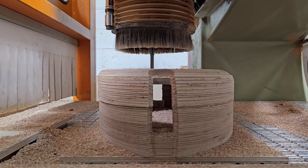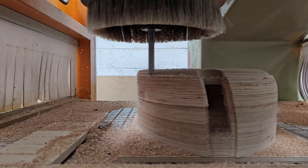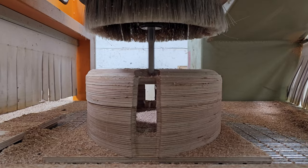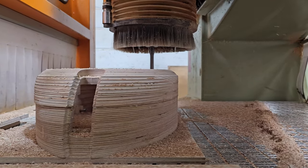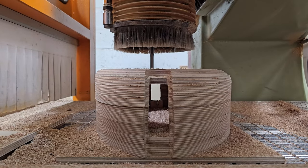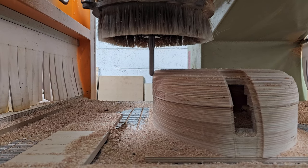So it's got a 10 horsepower spindle, 10 position auto tool changer, ISO 30 tools, which we've got a number of pre-set up. So while it's only got the 10 positions in the tool changer, we've actually got space for 30 offsets in the controller. So I can have up to 30 tools set up.